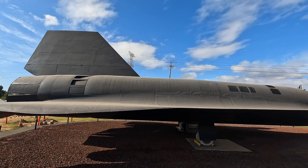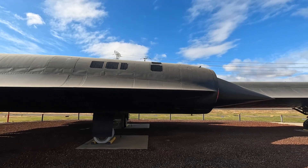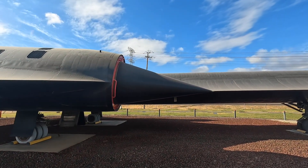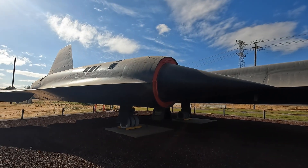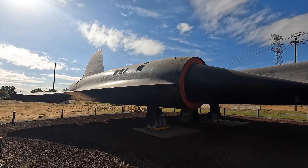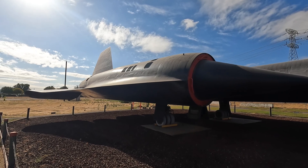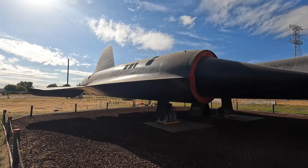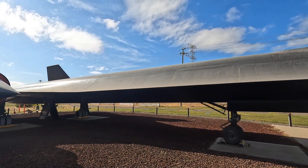The back of the nose piece is real — it's got quite a bit of the telemetry in there for all the spy stuff. I believe it was a ground mapping radar type thing that basically took a picture. The engine itself, the J-58 Pratt & Whitney, is about half the size of this nacelle. The nacelle is very complicated with air passages going all kinds of different directions. The engine itself holds all the fuel system stuff, so they can swap out these engines pretty quickly — they actually unhinge and the whole thing pivots up, and you can see that at McMinnville.